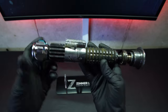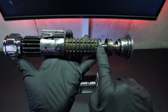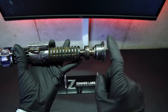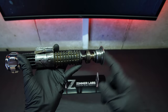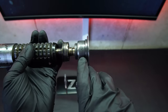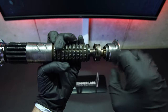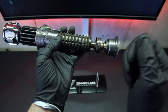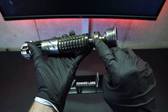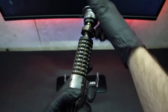I did some acid washing and some black patina. The acid in the patina is what gave it this rust look inside here and what also darkened up the whole top. Then I used a small ball peen hammer and just wailed on it all over the place — that's what all these little round pockmarks are, just little hammer strikes. Occasionally you want to really whale it for that one good battle damage look. Don't hold back, just let it rip.